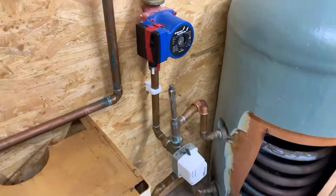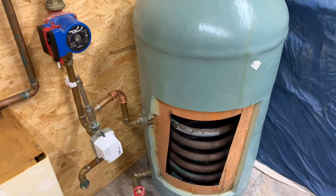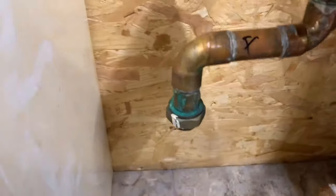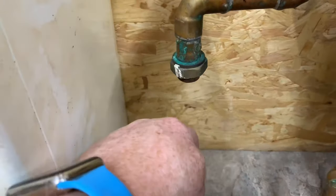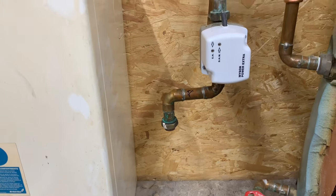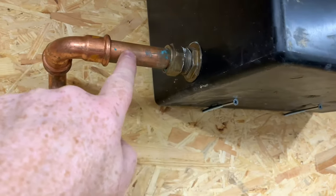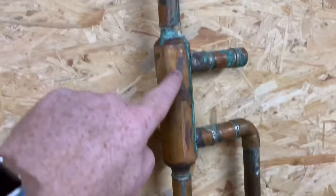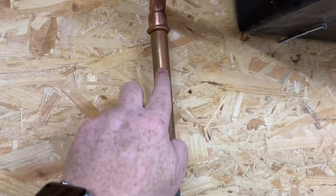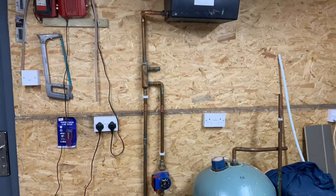The flow pipe comes up from the boiler and in this case goes to the pump. The pump feeds back to the diverter valve's A and B ports: B goes to the coil in the hot water cylinder - that's how you get your hot water - and A goes to your main central heating flow to feed the radiators. The system fills via the cold feed pipe - cold water comes in and goes into the heating. Air from the system also exits through the cold feed, as it's a combined pipe.